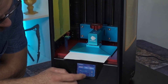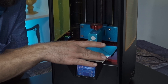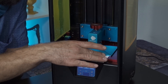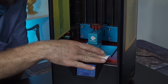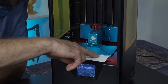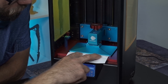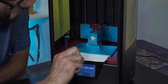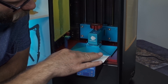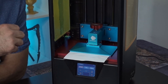Right there I can still push the paper in, so we can go down another step. I can pull it out and I can still push it in. Going down one more. I can still pull it out and I can still push it in but it's tricky. And just like that I'd say that we are nice and level. She doesn't want to push in — at least it's very tough to — but I can still pull it out. Going one more step. Pull it out — yeah, that's my magic position right there.